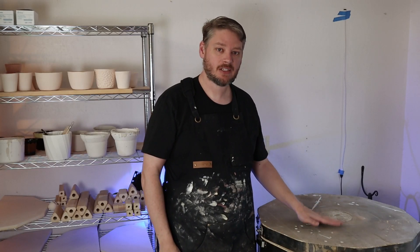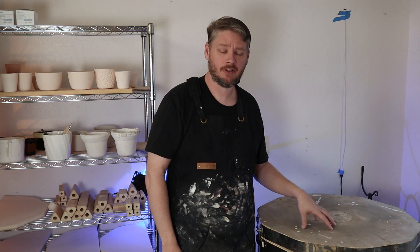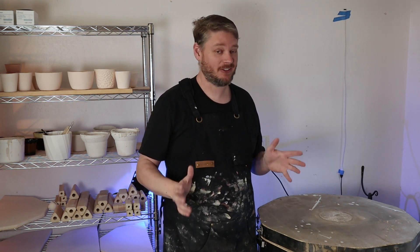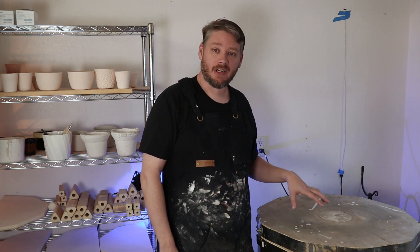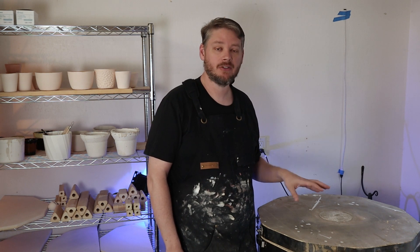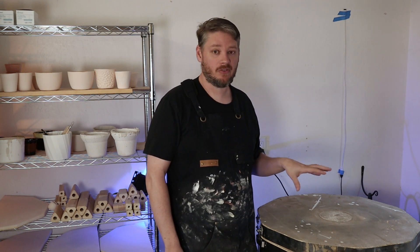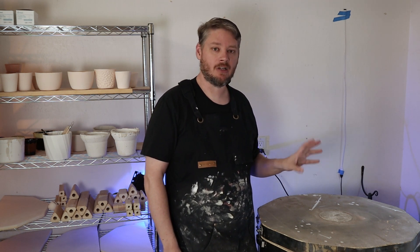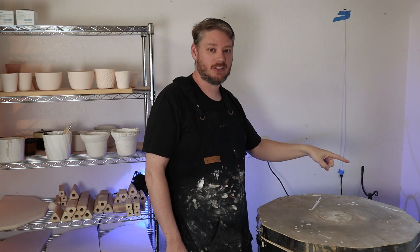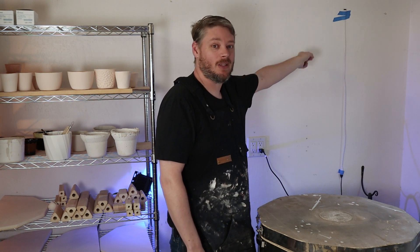It's a couple days later. I've been doing some test firings of my kiln at low temperature, bringing it up to 200–250 degrees, and the highest I've gotten is about 700 degrees. I'm not trusting anything I've done just yet — these videos are documenting the process; they're definitely not a how-to, they're a 'what I did.' Today I want to bring it up to full temperature and do a full glaze firing without any pots. I'll put in my kiln furniture and cones to see if the thermocouple is reading correctly — the ground truth will really be the cones. Also, since Wi-Fi can't get out of the metal box, I ran a USB extension cord out and up the wall and taped it on for now. Eventually I'll find a more permanent solution — or maybe blue tape is permanent.